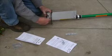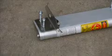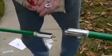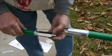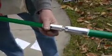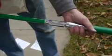The antenna is a 5/8 wave antenna. At least that's what they advertise. I read somewhere that somebody took one of these things apart and they measured each of the sections and discovered that it's actually, instead of a 0.625 or 5/8 wavelength, it's actually 0.640. And that's one of the best kept secrets about CB and 10 meter antennas. They used to have ones called a Super Penetrator 500. It was a 0.64. And they say that this thing, you get 0.4 dB more gain from this antenna than you would a 5/8 wave. So that's the secret of the Max 2000.